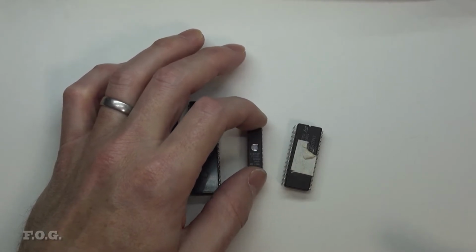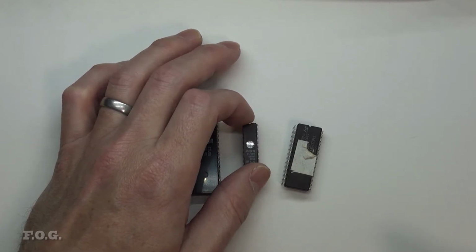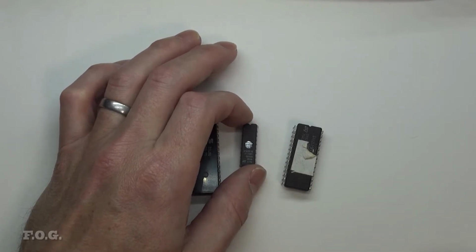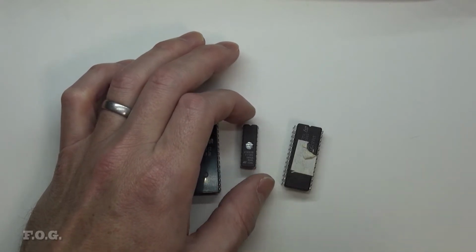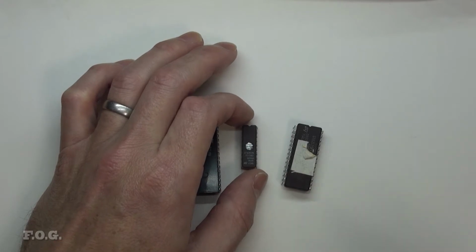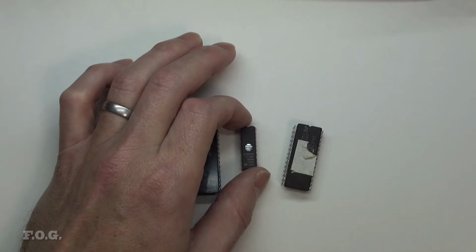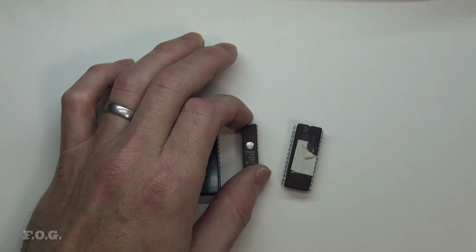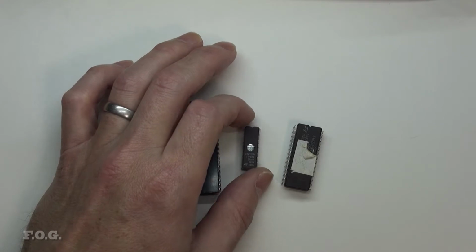Now I think you could write in C as well, but we're talking about an extremely small amount of program space, 4K of program space, and you're also dealing with 64 bytes of RAM and just a handful of registers. So once you get into writing in C and the compiler doing its thing, it's replicating patterns of things to achieve those C-type commands. You're never going to get super efficient usage of code space or memory space in that scenario. So it never really crossed my mind that I'd be writing for this chip in C, even though probably some of my peers were doing it.